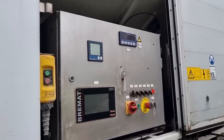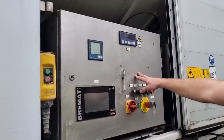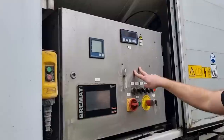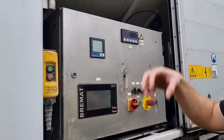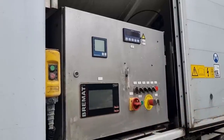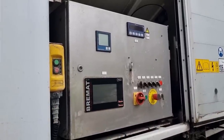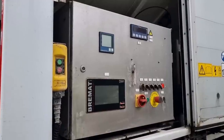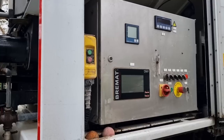And how many cubic metres can you batch or make on this lorry? On this truck, a maximum of 20 cubic metres. That's a lot of area. That relies on a delivery of sand, so a grab lorry will come in and top the sand up. And then we can get a maximum of 20 cube off there, which is 400 square metres at 50 mil. Is it? 400 square metres? That's a warehouse, it's a big area. Yeah, we have done a few warehouses.